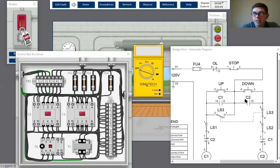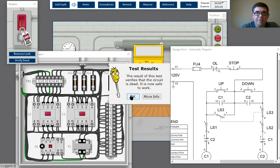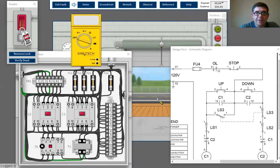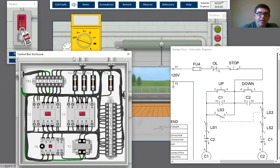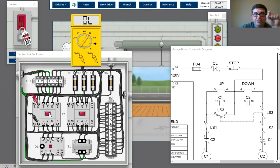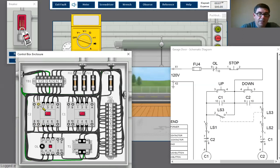Let's take our screwdriver and go in. I'll verify dead first so I don't get ripped for that. So between 9 and 10 on C2, I'm going to disconnect here. Oh look at that — the terminal seems to be loose. Let's go ahead and disconnect and check resistance between 9 and 10. You can press that little red plunger — that's the solenoid that slides in and out and makes those contacts. If I push it I should get zero. And there it changes to zero, so that contact's good. Most likely when I hit that switch, I loosened it up — or it was already loose, and when I hit it it said tighten. That's got to be the problem.